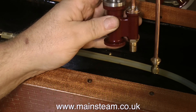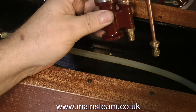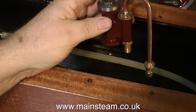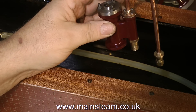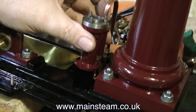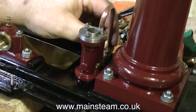This is the water pump that fits on the bed plate, and the couplings from the water pump have to go to the outside of the engine. In the last episode I showed how I made the fittings to take the other end of the flexible couplings, and now it's time to make the fittings to connect these flexible pipes to the water pump. First of all, the water pump needs fitting to the bed plate.